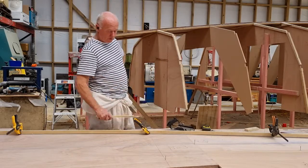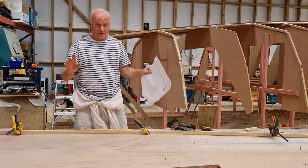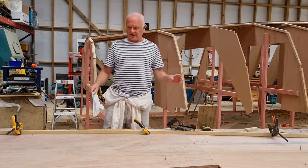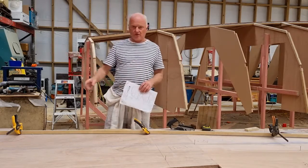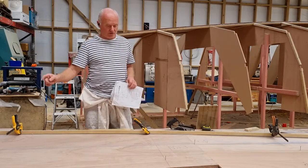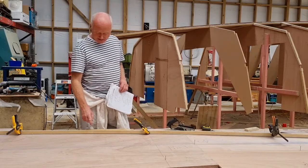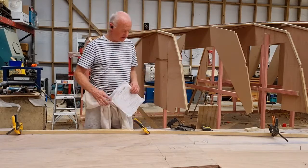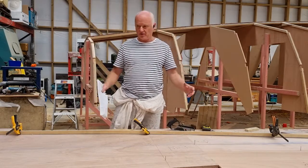So I was keen to stay with something decently stiff. I've got the last two sheets here, so I thought I'd better do a video before we get too far down the track. Basically what you've got to do is mark two sheets out at a time. It's really important you get a true centre line right down the whole length. You keep transferring the centre line from one sheet to the other, and also this curve here — they're not going to meet on a station, they're going to meet halfway between a bulkhead.